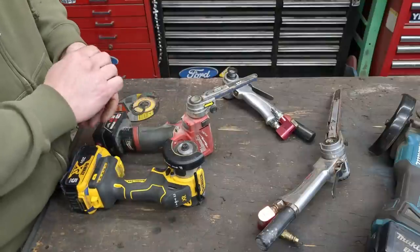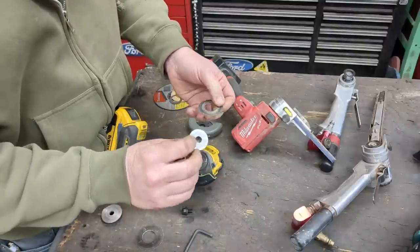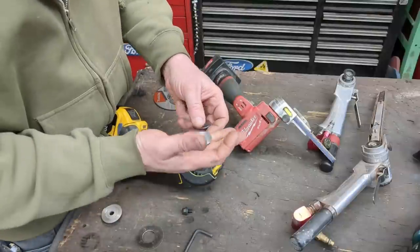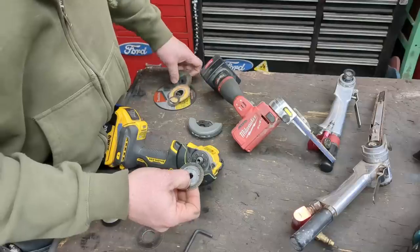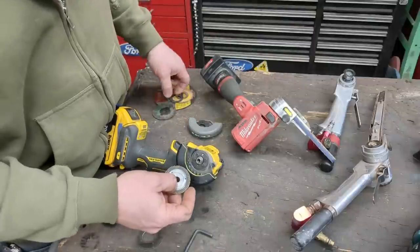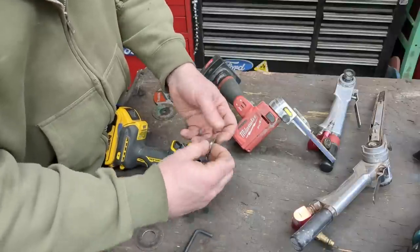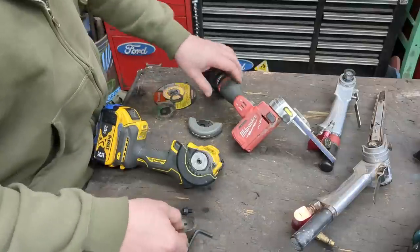We're going to do this modification and I'll show you how I did that. It's pretty simple, and most people have already figured it out. I turned these on the lathe, but I don't think that's necessary. All I did was create a step washer — this is a 3/8-inch hole — just a little step washer. Normally you'd put the blade directly on there and tighten it down with the included washers. I made my own washers — one is just a little bit thicker; they're essentially fender washers. It just holds the disc centered. You don't have to do it on the lathe; you could do this very simply with just some fender washers.